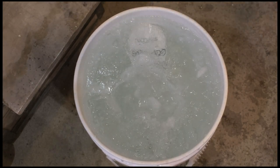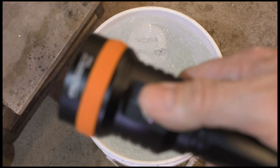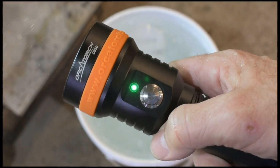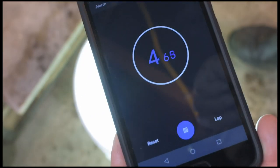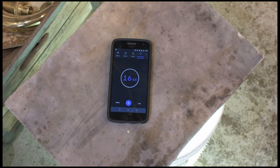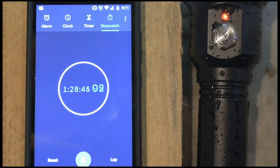Let's do a more harsh test — we're going to throw it in some ice water. This water is really cold; I've never tested a light in water this cold before. On the high setting with a fully charged battery, we're going to pop the light into a bucket of ice water and see how well it does. This is a really good test for any ice diving or cold water applications. I set my timer and let it run, though only about an hour and 20 minutes this time. After an hour and 28 minutes, I came back and pulled the light out. The LED is blinking red, which means it has less than 10% battery left. That's pretty good.